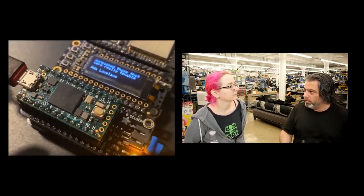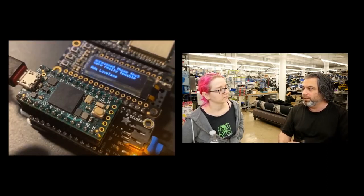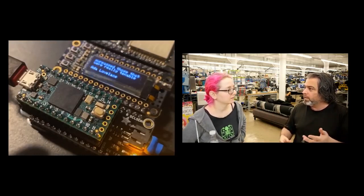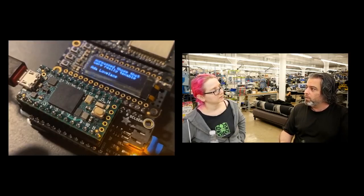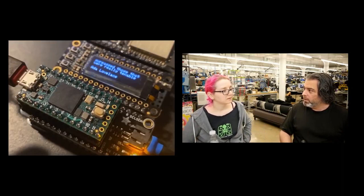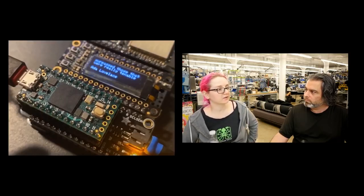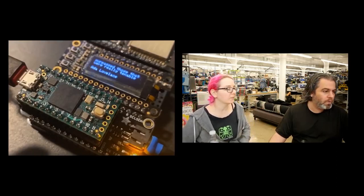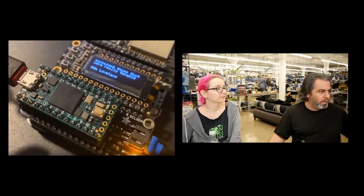This is where it gets really cool. Because CircuitPython gets you so many things on a board, I didn't see many IoT Teensy projects before — it's more known for audio projects. But once we had CircuitPython running, in less than 20 minutes we were able to put together an IoT project with the Teensy. It just worked. The default I2C speed was a little fast so I slowed it down, and the SPI frequency was twice as fast as it should be, so I tweaked it. Once I fixed the peripheral speeds, everything worked fine — it took longer to answer the door and get a snack than it did to do this project.